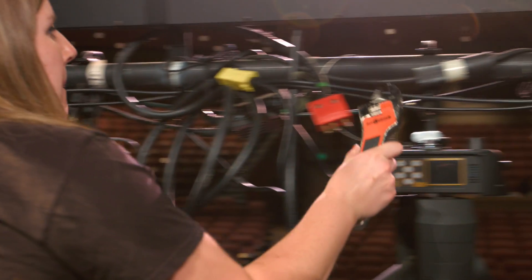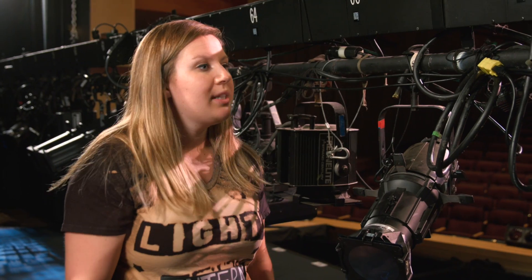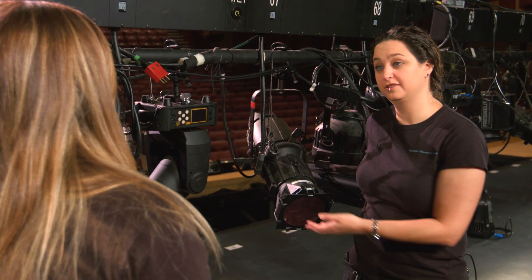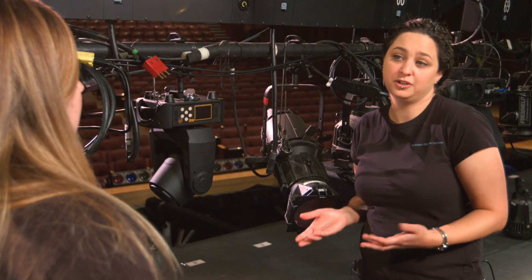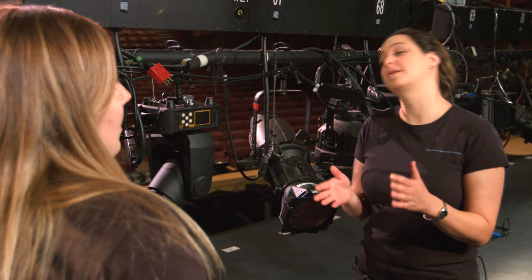Okay, sure, I can do that. Hang on a sec. Before we do this, we need to make sure that each through-power module is set to either dimmed or switched mode at the circuit. What's the difference? If we plug a motorized fixture like this into a dimmed circuit, it could let all the magic smoke out. But what's magic smoke? It means you damage the electronics.